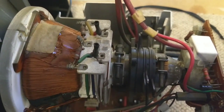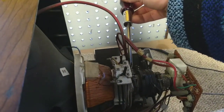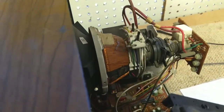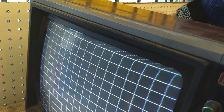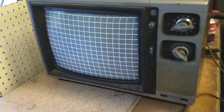So in order to adjust the leveling here, we have to loosen that nut on the yoke and then rotate the yoke. Be real careful because sometimes manufacturers were stupid and they glued it on here. So I'm going to try to loosen this a little bit and see if we can rock it. With that loose, you want to grab here — not the coils obviously — and we're going to rotate it. It's pretty well stuck, but that's enough to make it look level in the picture at least.